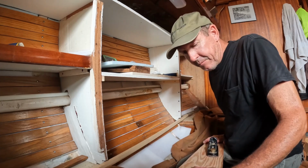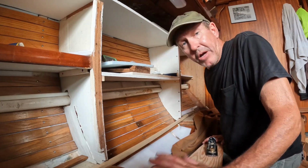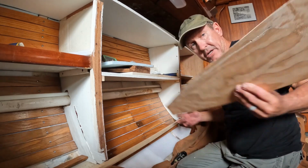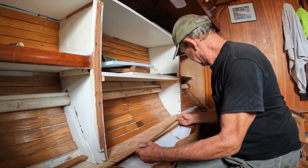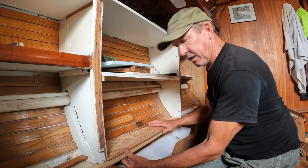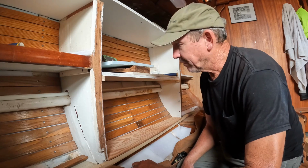We're going to go ahead and paint this and put it in. We won't bore you with the painting, but anyway, that is how we go about making a pattern to make an awkward sized or shaped shelf to fit in places on our boat. And we use this method quite a lot, and it works really, really well.